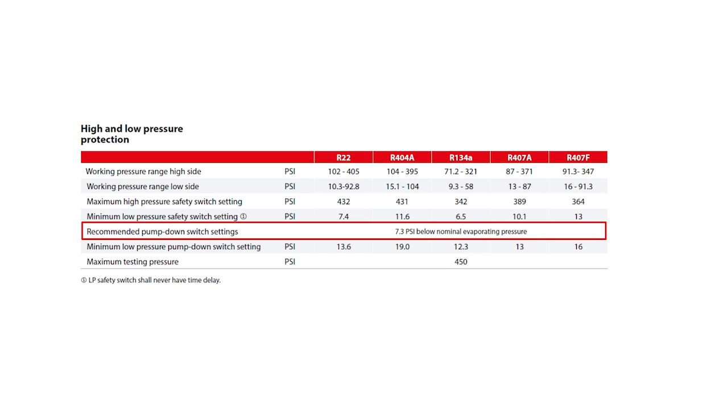There's one thing you have to be careful of, and that is with scroll compressors. There are a lot of scroll compressors coming into the refrigeration market. They're great for operating around a given compression ratio, given evaporator temperature, and a given condensing temperature or pressure — they'll give great efficiencies. However, they cannot operate in a vacuum. So never set a pump down cycle for a scroll so that it cuts out in a vacuum. You need to take into account your differential as well as your set point and make sure the cutoff point is not in a vacuum.